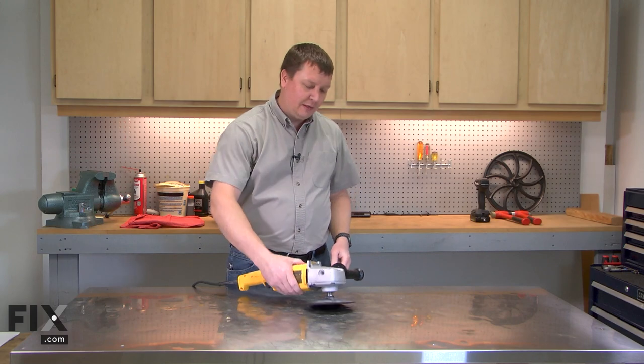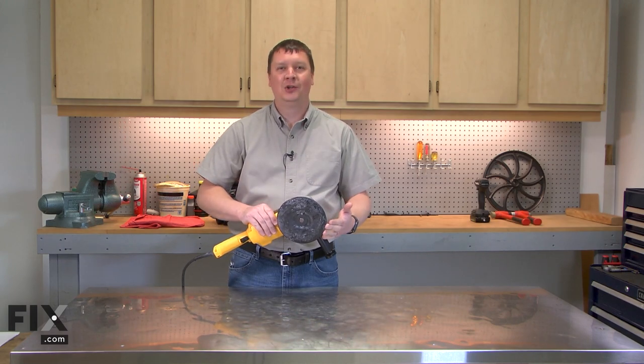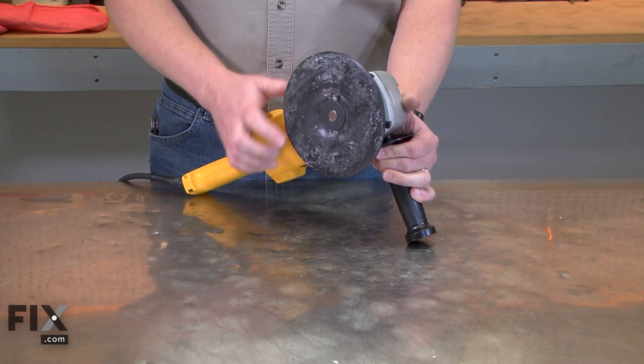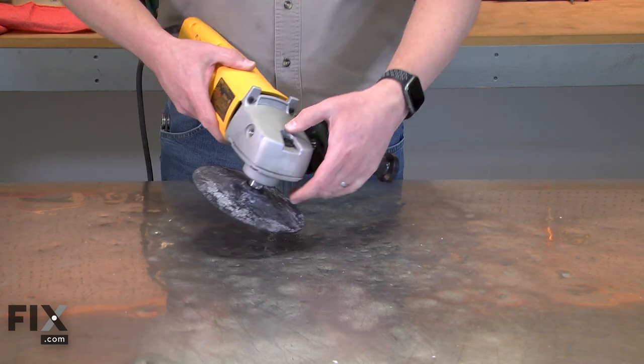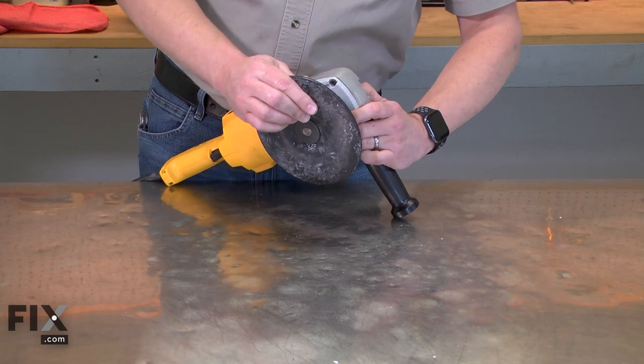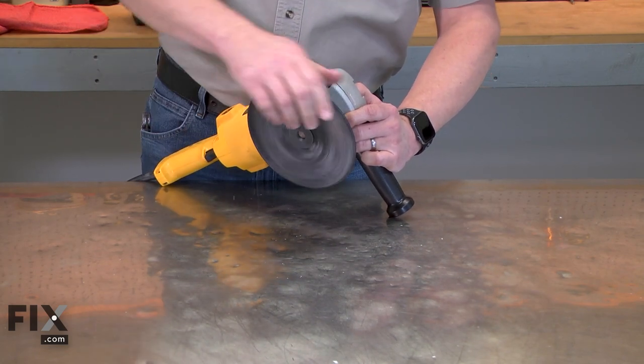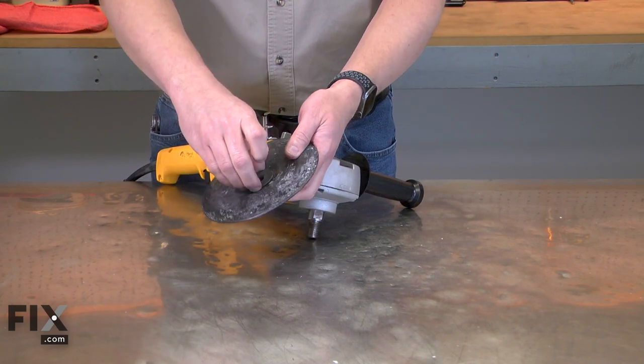I'll begin by removing the old backing pad from the polisher. The backing pad is secured to the polisher with a nut. To remove it, I'll lock the spindle and then rotate the pad, which will unscrew the nut. Now remove the nut from the pad